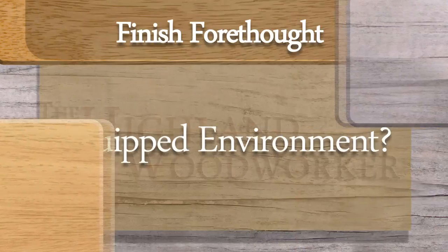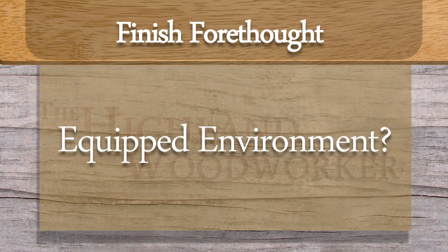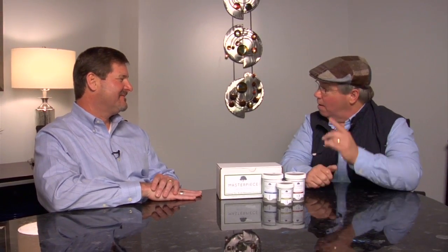Well, also the consideration of equipment. Like I said, I don't have in my shop a clean room. Then you have to have certain spray equipment, clean, dry air. Do you have those kind of things in your shop, Chuck? At one time I had lights that were explosion proof, and I had a motor that was explosion proof, and I don't use any of that anymore. But if I was building a type of furniture that required, let's say, a lacquer finish, I would have to go out and build that kind of an environment again.